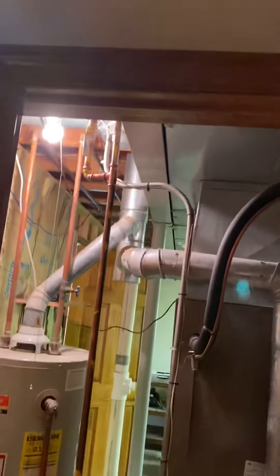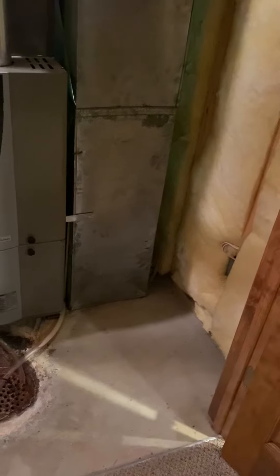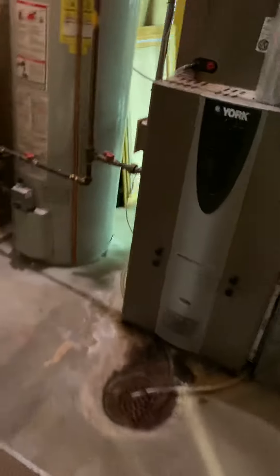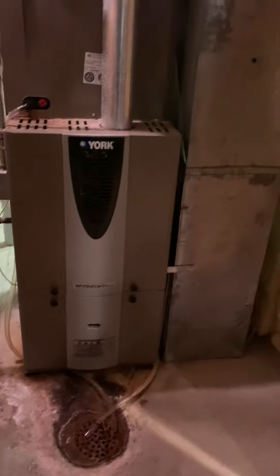The drain is real simple right here and the gas piping looks good there. We also want to add a basement return — bring in an eight-inch elbow, eight-inch duct, eight-inch start collar, and a six-by-fourteen register. We're just going to go through the wall and put a register right over here on this side of the wall, low on the wall near the TV.